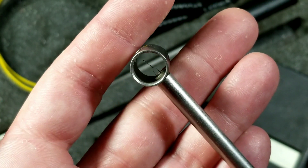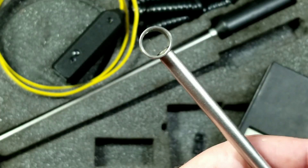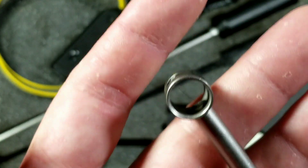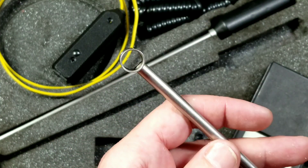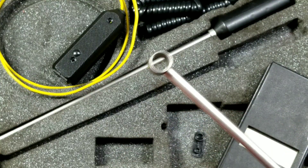What they also tell you is that it's a four-thousandths-of-an-inch piece of wire, so it is more accurate in heat soaks, but it is obviously quite delicate. And the wire is also twisted, though I'm not exactly sure why. Temperature probes are essentially a specialized piece of wire where the resistance changes depending on the temperature, and that's what these units read.